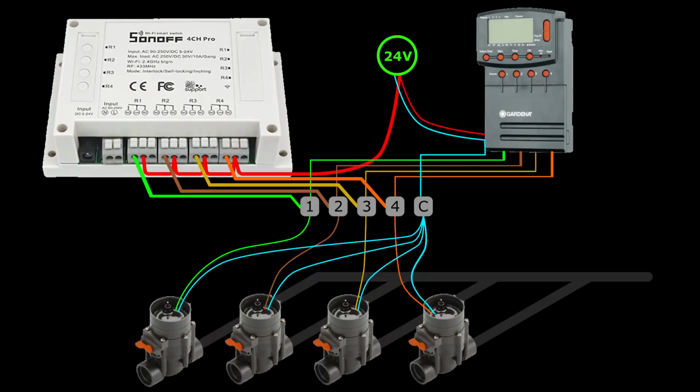For the display, I will use my favorite iTead Nextion HMI, and that needs 5 volts. And the Sonoff can also run on 5 volts. So what I will do is get a 5 volts adapter and use it to power the Sonoff. Looks like I could have gone with the generic 8266 after all, but at least I don't have to worry about soldering in the box.